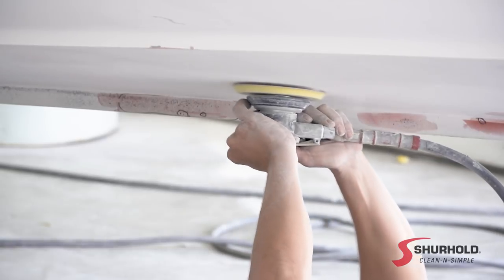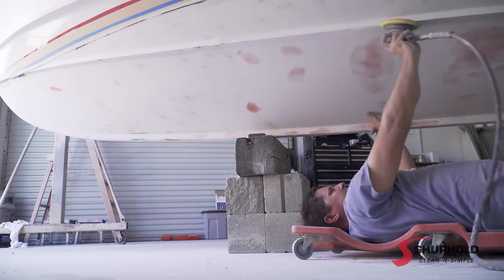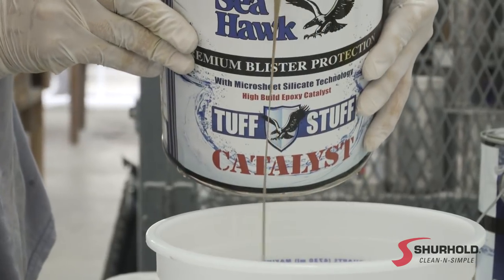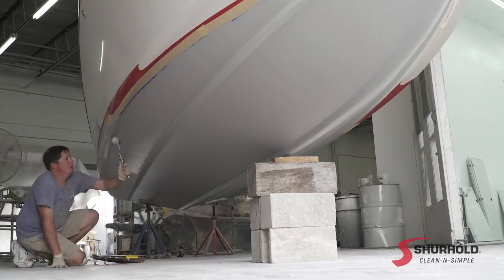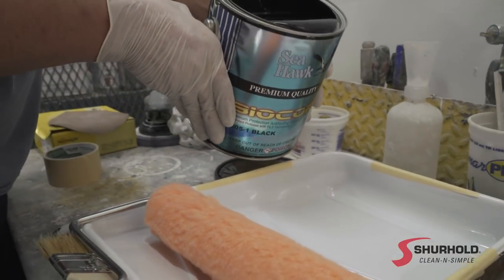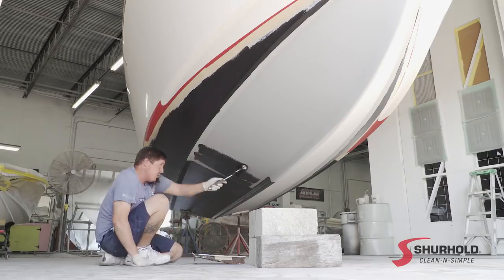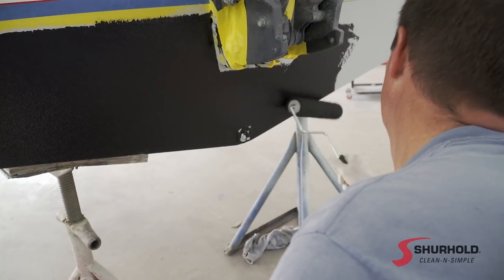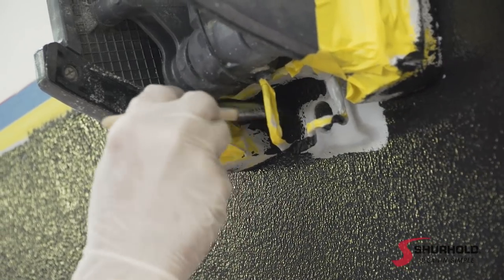On to the bottom paint. The boat was sandblasted for me, so I just went underneath and touched things up, sanded it, made sure everything looked good — no big divots or anything that needed to be repaired. The next step was a two-part epoxy barrier coat, which helps prevent water intrusion getting towards the hull while it sits in the water. Once we finished the epoxy barrier coat, we went ahead and applied bottom paint. The owner decided to go with black to tie in with the rubber rail. We used a regular 9-inch roller following the manufacturer's guidelines on nap and number of coats.